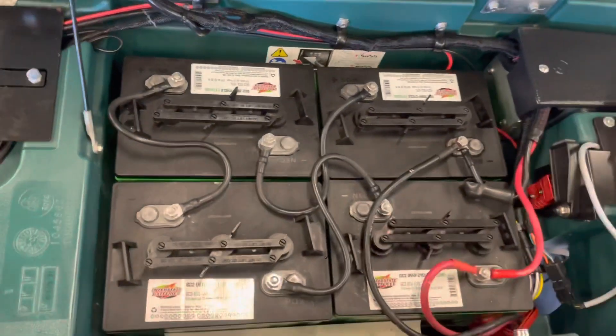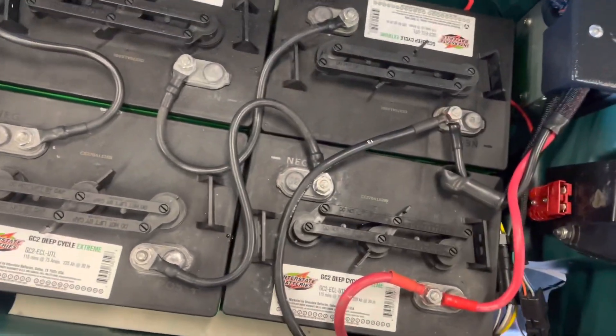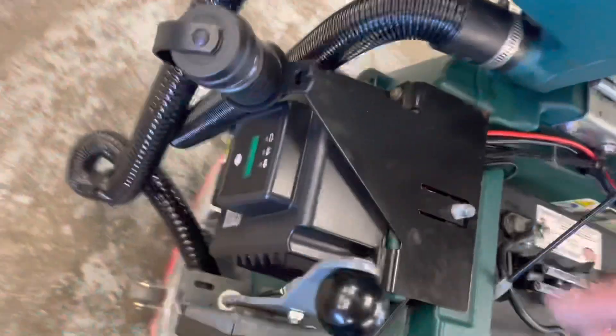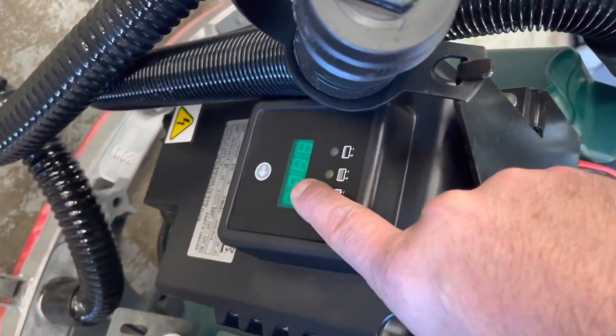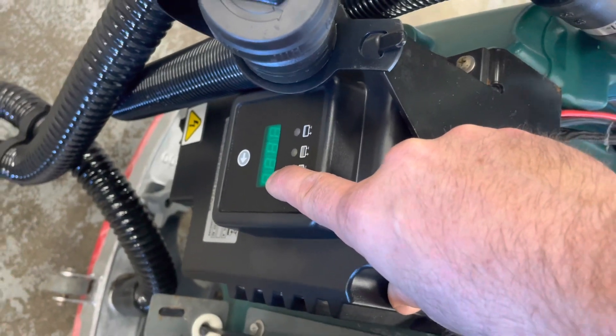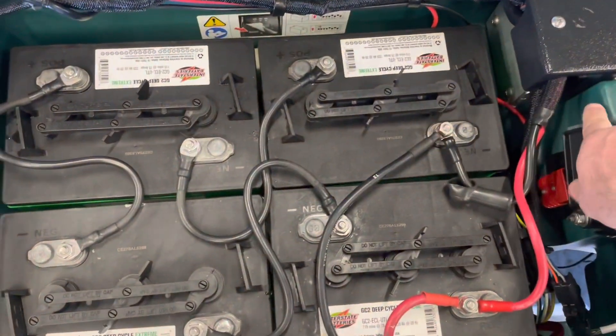If your battery voltage was extraordinarily low, you'd want to make sure that when charging, you have the tank lifted up and the charger connected. If you do not, you'll have a BAT signal at the back, indicating that the charger is not connected to the batteries. But assuming we have good voltage, we're going to go on with our diagnosis.